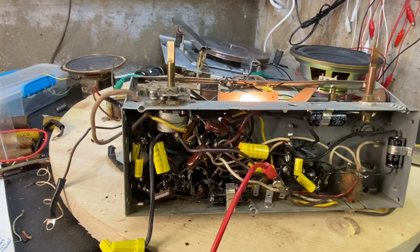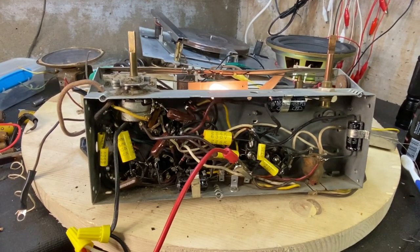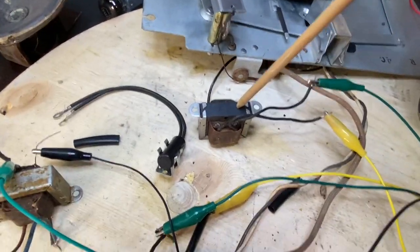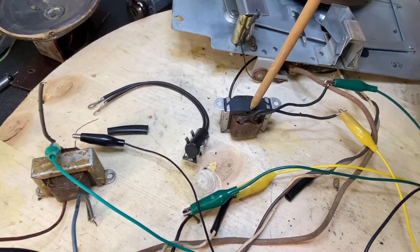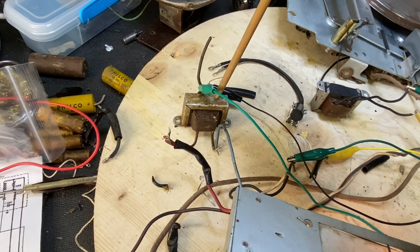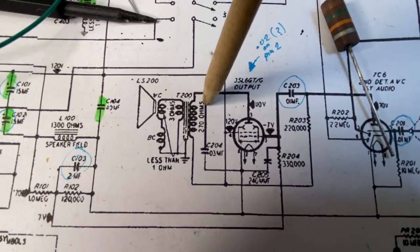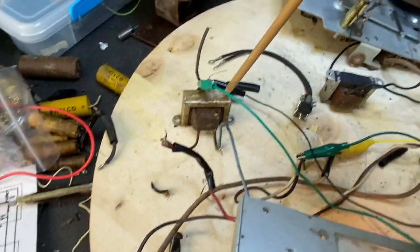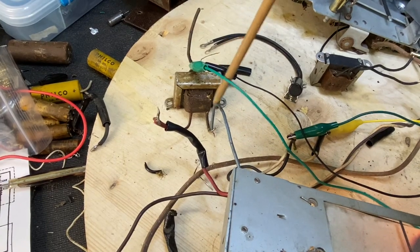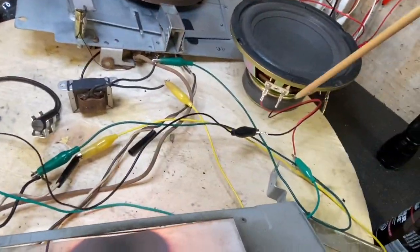So when it was going and I was playing, I just had this massive noise. I can get a station, but it was terrible. I have this one here that I had laying around — it's a 512 ohm. And this coil with this speaker isn't the right one either. This one's supposed to be 270 ohm on one side and 3 on the other; it's like one and a half and 180 on the other side. With everything hooked up, I've just got a regular speaker on this guy.